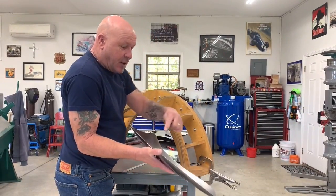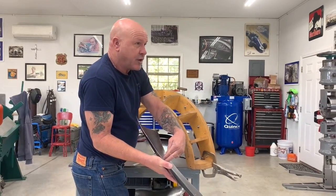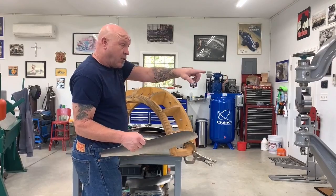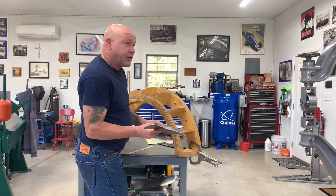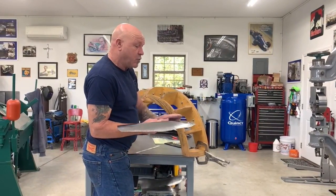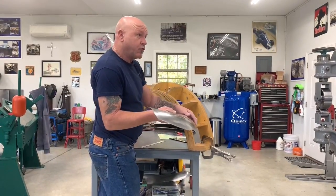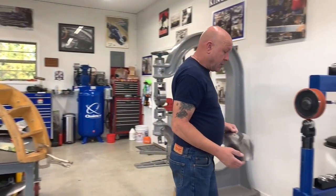So that tells me there's not enough shape in this panel here. So we need to put more shape in it. You have two ways to do it. Either we jump into the wheel with, stretch it linear this way, like we've been doing, or you come in with a cross wheel and put in more shape through cross wheeling. They're the two options. So I'm going to put more tension?